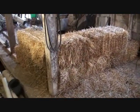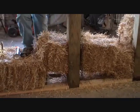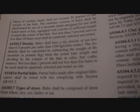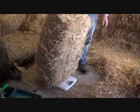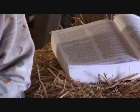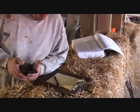We've never done this before, so this is a new experience. Bob and I thought the process was going quite well, but then we discovered something that threw a wrench in our gears. Bob mentioned that he thought the straw bales were kind of loose, so we opened up the code book to the section on density. The code book mentions that the straw bales have to be of a certain density — that would mean the size of the bale, the moisture content, and the weight all have to be computed together, and it gives you a number.